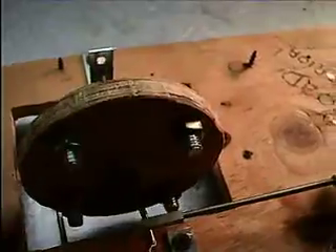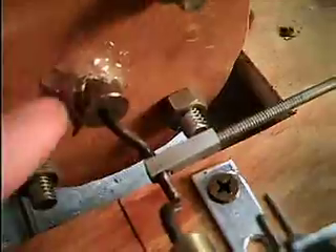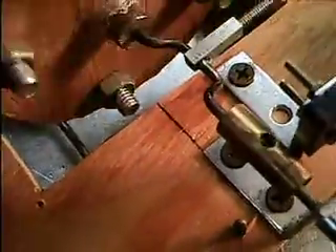The flywheel is a four-inch diameter piece of half-inch plywood with a steel hub — a half-inch steel hub with a hole drilled through it. Set screws put in on each side and just hot-glued right on. Five-sixteenths bolts for some weight.